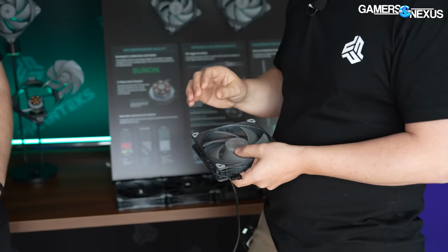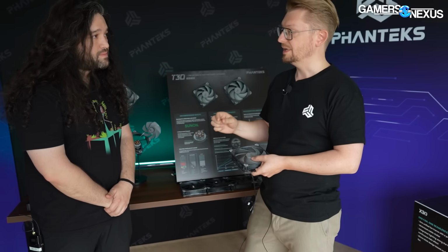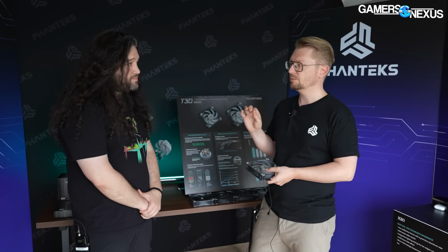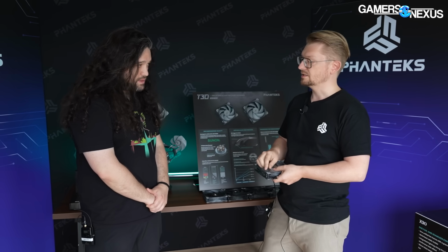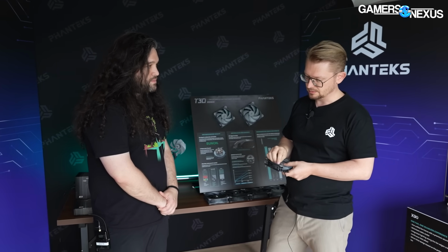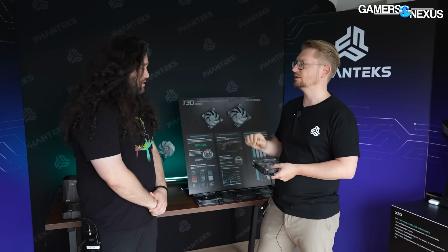And what we do is we have a clearance of 0.9, but it's parallel. And honestly, the only number that matters is the one at the tip, because that's where the air gets flung to the edge and it wants to escape at the front, at the top end. So really the tip clearance is the one that should matter.